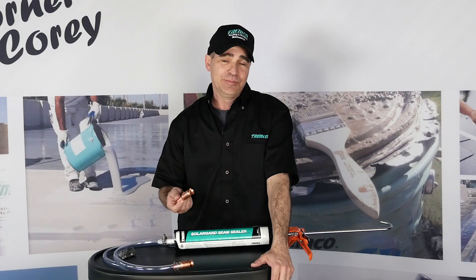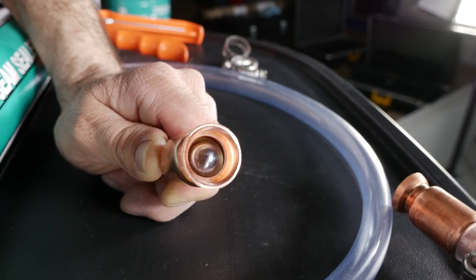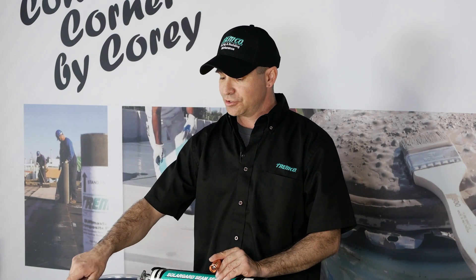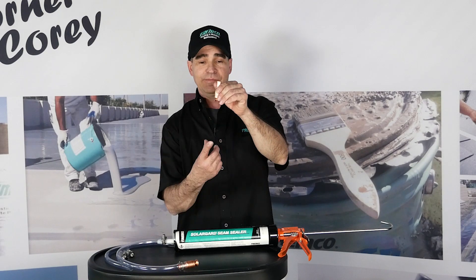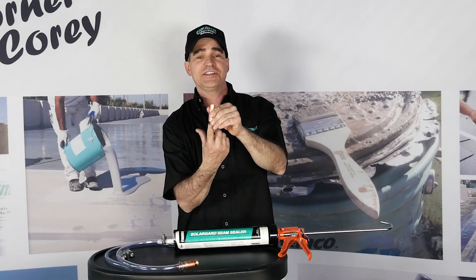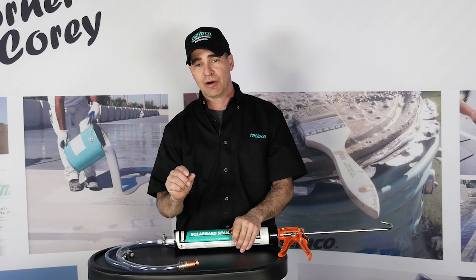However, I'm using this product in reverse. What we have here is a bell with a marble inside. This marble acts like a ball valve. When the product flows down the tube and enters the ball valve pushing the marble to the opening, it cuts off the flow of product. Every time you put this bell down onto a fastener, it pushes up on the marble, releasing the perfect amount of product and giving that fastener a pressure seal.